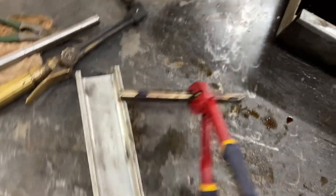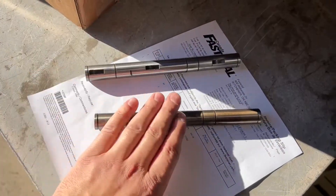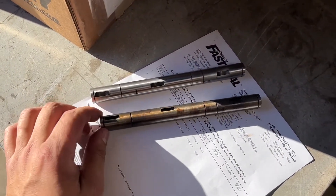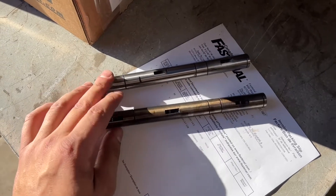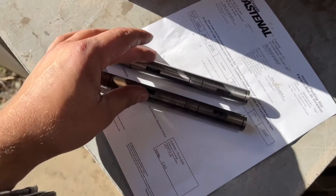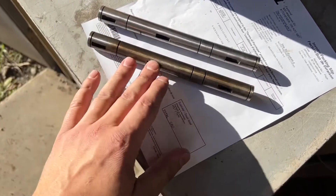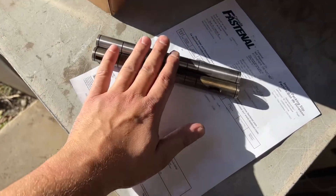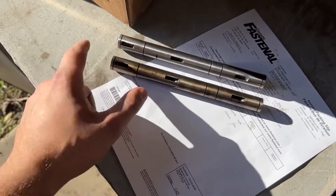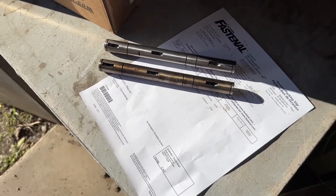It should be good there to quench. Here's the shaft — this is the one with all the temper colors. I can just leave that on there; it just cooked a bit of oil on there. It's worth saying that it probably would be best practice to dump this in vertically so you don't get any stress. But before I sent this out, I just ran a file over it and made sure it still had hardness. Should be good to go — we're good.